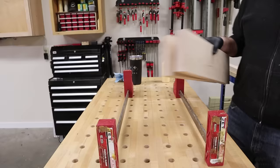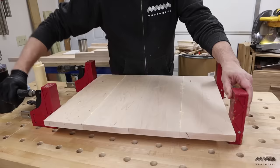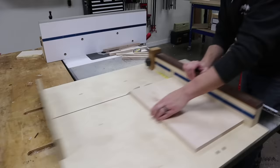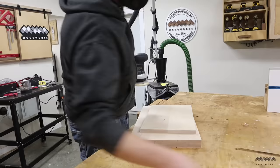Finally I need to glue up my door panels, which are going to be made from two boards each because I couldn't find material wide enough to make them with a single board. I gang two panels together in the same set of clamps to make things more efficient. Once the panels are out of the clamps, I just need to trim them to final length using my crosscut sled — I have a video and plans for the sled too, links in the description. Next comes the brutally boring part: sanding. I need to get these panels sanded to 120 grit, removing the glue lines and any runaway glue that might cause a high spot for the next step.